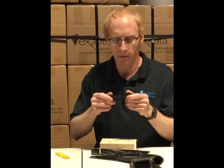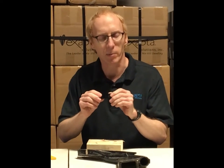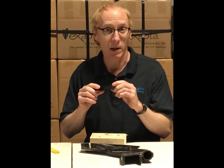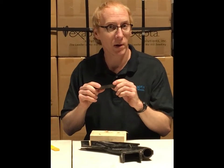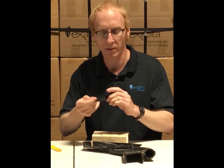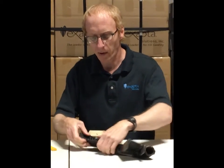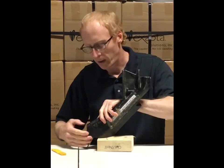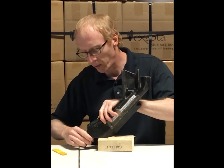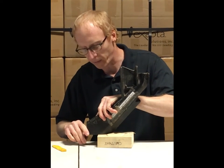Some might say, why flexible? Well, flexible is an advantage in this case. For one thing, it ensures that the flap is never going to break — there's no brittleness here. You can do all sorts of things to it and it springs back into shape. The other thing is that we're looking for basically a curtain here, not necessarily something that's protruding way back, but something that's more like a curtain to knock the seeds down into the bottom of the furrow.